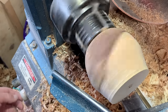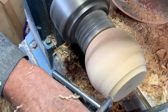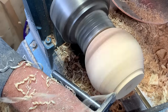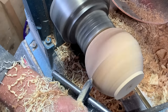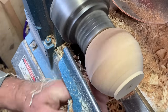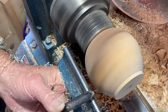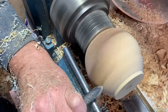Now shape the rest of the top. Half inch spindle gouge again. Tall cut here. Looking a bit ball like now, so maybe a bit more asymmetry into it. And we're not supposed to go against the grain, which I am here.